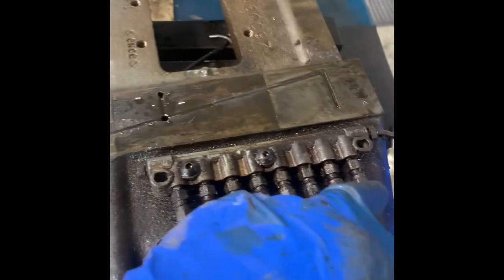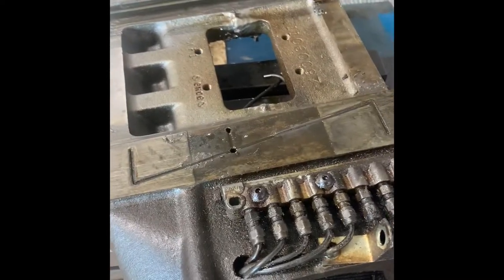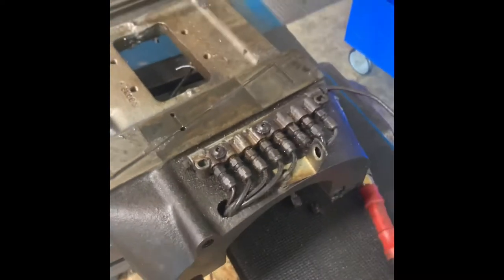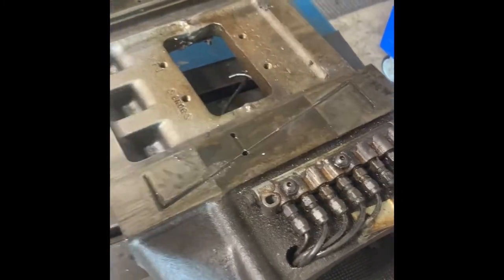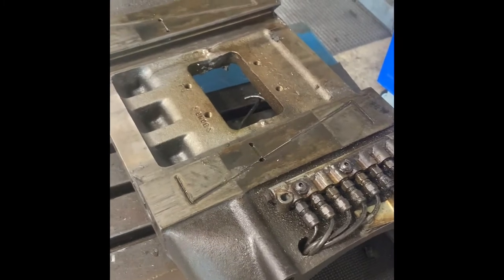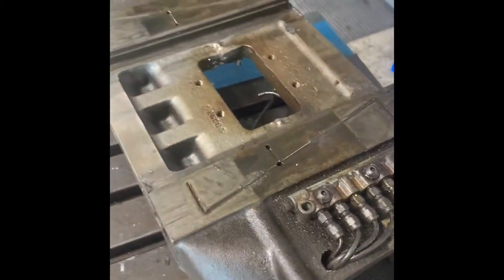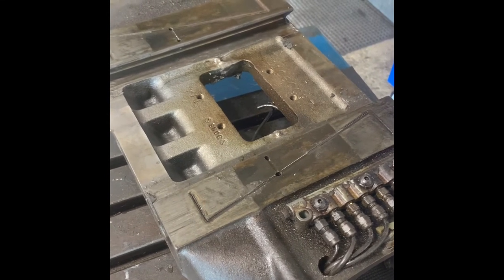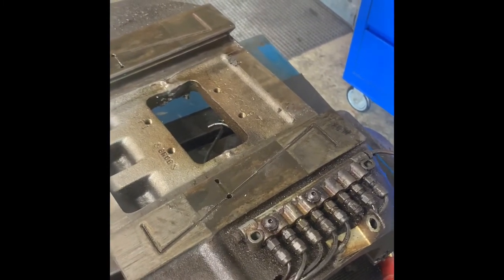Oil penetration is huge. These are limiters on the bottom of the Bridgeport saddle. Just because the axes move and it seems like the oil is pumping when you pull up on the handle doesn't mean that it is. To check that all these limiters are working, when I pull the saddle off I put air to the inlet and blow it. I wait — usually about 30 seconds — until all of the ports are blowing bubbles with oil. Not only does that move all the dirty oil out, but it also ensures the limiters aren't clogged up, which a lot of the time they are. This is another thing you get when you buy a machine serviced from Machine Tools Rebuilt.